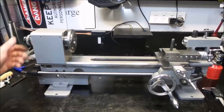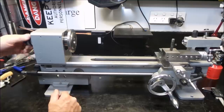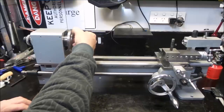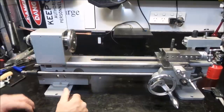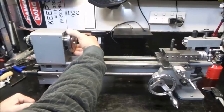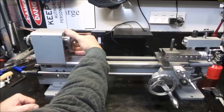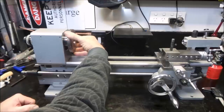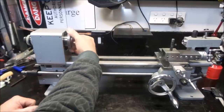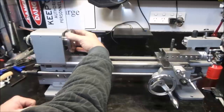She's firmly affixed in position again, all rebuilt and ready to go. I guess I might take some more measurements. One thing I did notice — I forgot to set the dial indicator up on the register for the chuck, and just looking at it, it's pretty rough. It could be — it probably is — the cause of the runout on the outside of the chuck when it was mounted. I'll set the dial indicator back up and recheck this and see what it looks like now. Not that I really expect too much to have changed, but we'll see.